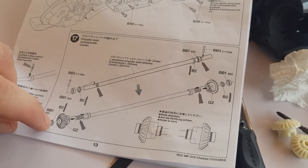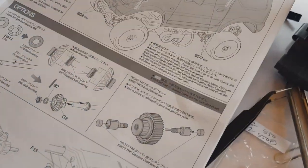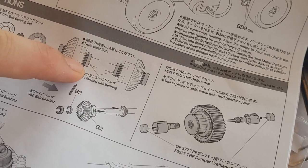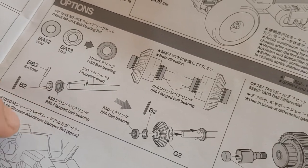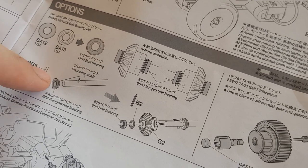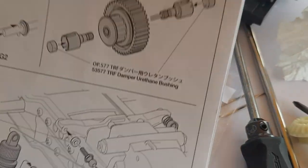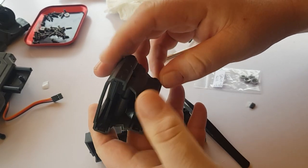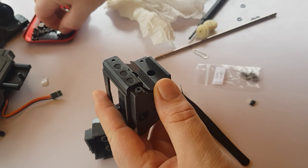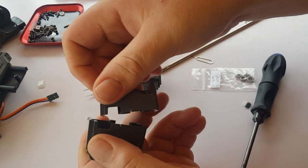We've also got to build this drive shaft up and get the bearings on — these are bushes on here. If you skip further ahead there's a section for extras, so if you're going with bearings you need to make sure the flange bearing is in here with a little B2 spacer. So you've got: B2 flange bearing, then your pin, then your gear, then the B2 spacer, and then your bearing again — same for both ends.